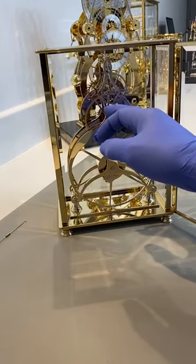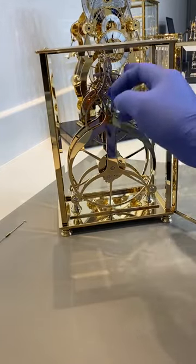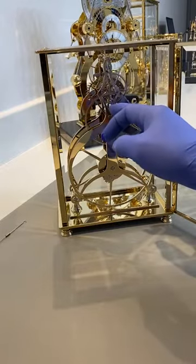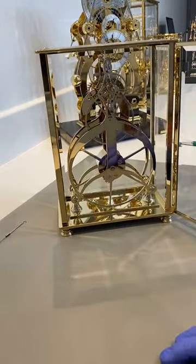The pallets are here, and this is what, when there's power on the clock, impulses the pendulum. From this pallet and escape wheel you get a little impulse — it gives the pendulum a little kick — and that's what keeps it going. So that's the first bit.